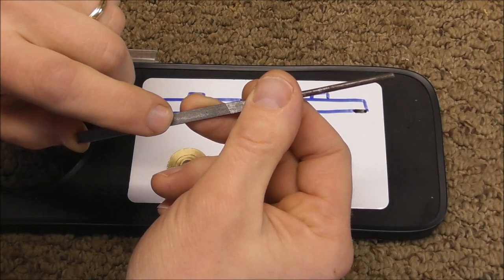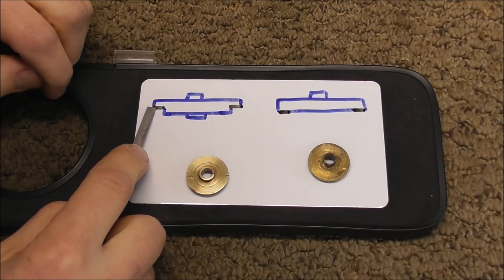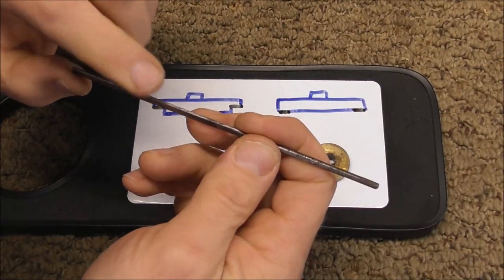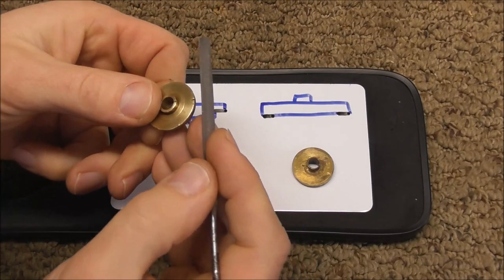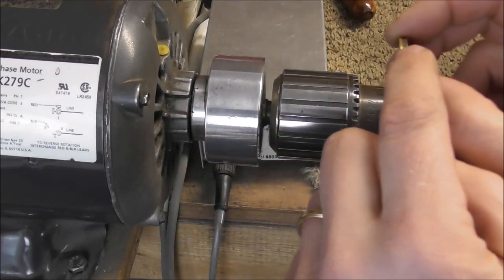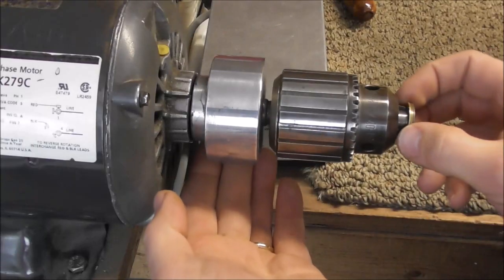This file does not have much grit because I do not want to take off a lot of metal — just a little bit. Be very careful to file down only the shoulder of the rotor bearing, not the side of it. One side of the file has grit and one side is smooth — you want the smooth side lined up to the side of the bearing plate. You'll need a bench motor or a lathe to do this job so that it files down smoothly and evenly. Put it in square so that it files down evenly.